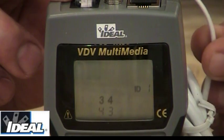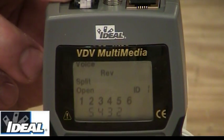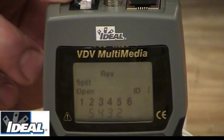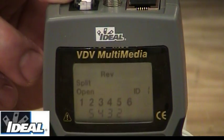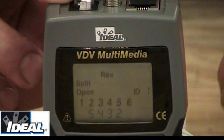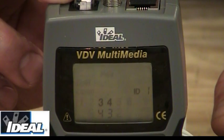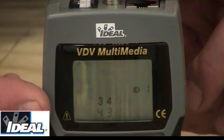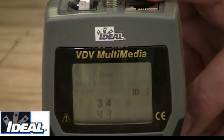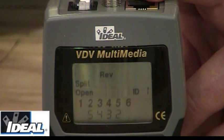Since this is a four-wire cable, you're only seeing four of the six wires the tester could see. Pins one and six are indicating an open on the bottom row. On the middle pairs, you're seeing a complete reversal of pairs — they're completely opposite of each other, and the tester is indicating reverse. When you look at typical telephone patch cords, old analog phones require those wires to be reverse-wired in order to work properly.